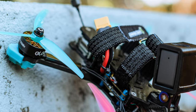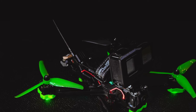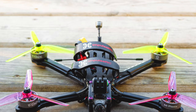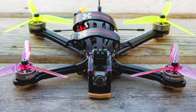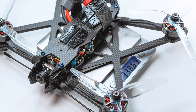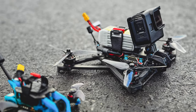I also have various 5-inch freestyle frames designed by FPV legends. They're all built like tanks, all with props in view, and meant to be used with a GoPro on top. Sure, some of them you can get a dead cat version, but usually it came at a performance penalty, or just made the quad even wider and less compact to gap stuff. So removing all of the unnecessary bulk, Proto 5 can be built 30 to 50 grams lighter than your typical 5-inch tank freestyle frame. With less weight, this allows you to carry the extra gear you want and still shred the cinematic environment.